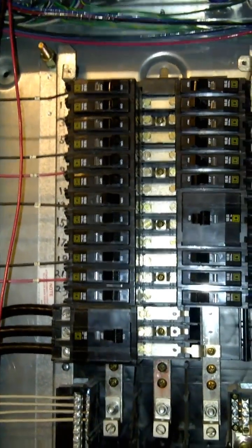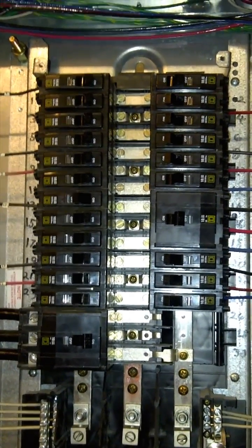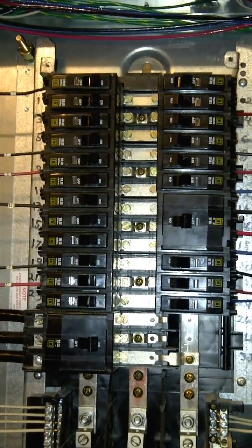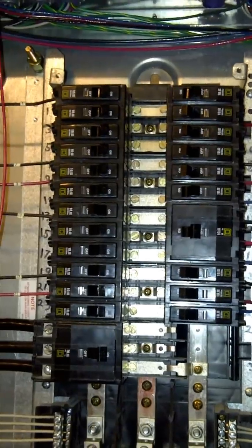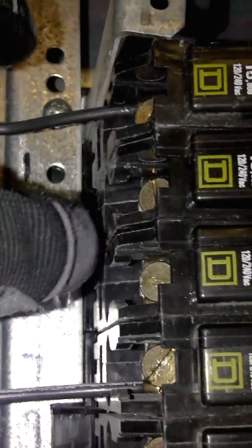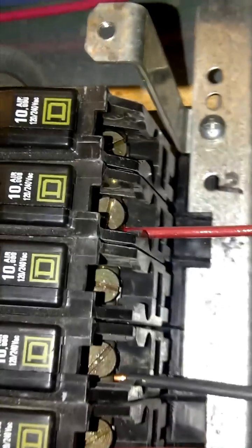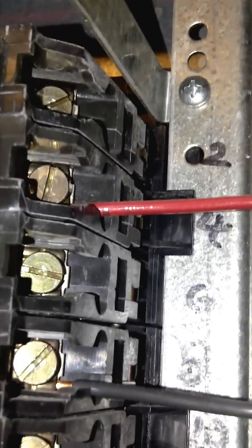In this case we're going to use phases A, B, and C with circuit numbers two, three, and five — because one is already used. So we have three and five, and circuit number two is not used, so we're going to use that one for phase A.